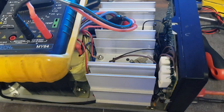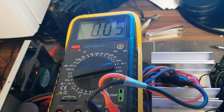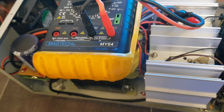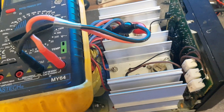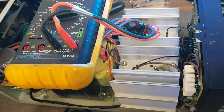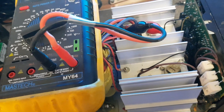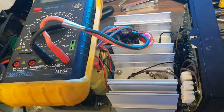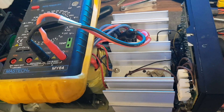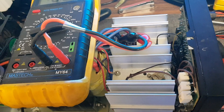At the moment I've got the multimeter connected and it's showing a bit of voltage — the capacitors haven't discharged yet. I was trying to repair this power supply and I'll make a video out of it to help other users with power supply problems. This is a linear power supply, not a switch mode. If you're a radio operator with expensive equipment, I don't advise using switch mode — always use linear. There's not a lot that can go wrong, and when it does go wrong, it won't shoot 30 or 40 volts into your equipment. Switch mode power supplies can discharge a lot of amperage and voltage when they fail.